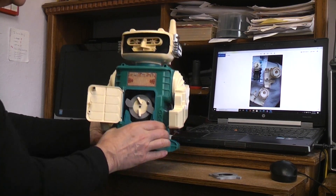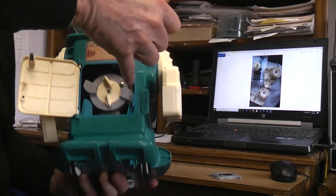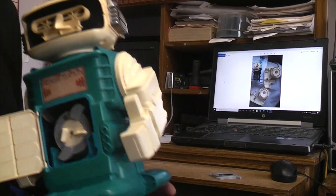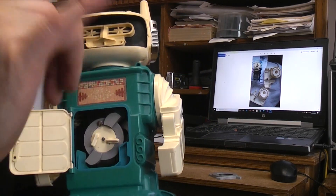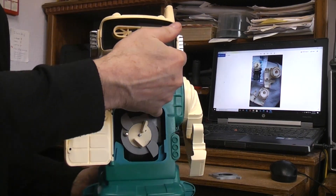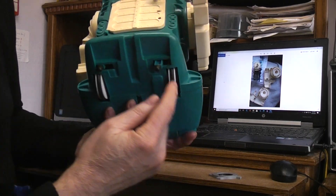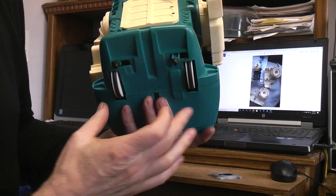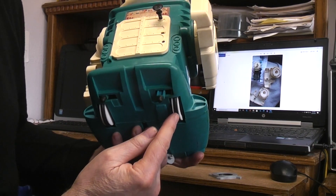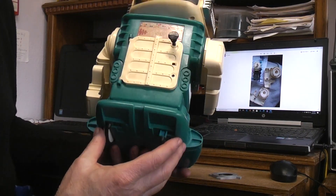Here's a view of the cams. I'm going to hold the on/off switch with my fingers so you can see the cams rotate. I got my finger caught in there — still got my finger though. Now you can see how that moves. What cams do is push these levers down. Both wheels are always driving, but these levers push down to lift one wheel off the ground or lift the other, and that's how they make the thing turn.